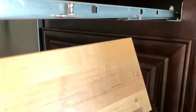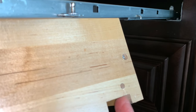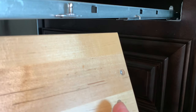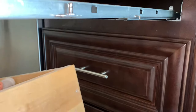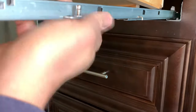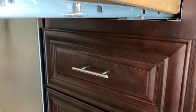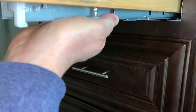On the back of this rail there are two little teeth — one at each end. They go into the back of this drawer; there's a cutout here where the rail sits and that tooth goes right into that little hole. To reinstall, you set the drawer back on the rails and you have to get the teeth in first in the back, otherwise the rails won't seat.